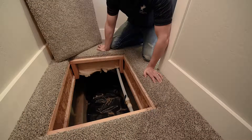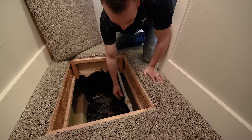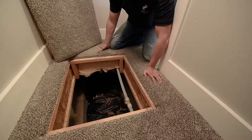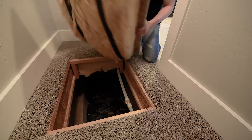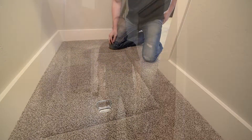So if you do have a leak, it's also helpful to go turn on other sinks or flush toilets when you're trying to dissipate the water pressure. Of course, once we solve our problem we can just quarter turn counterclockwise and we're back on. Then we can just put our crawlspace cover right back on like that. As always guys, thank you very much for watching.